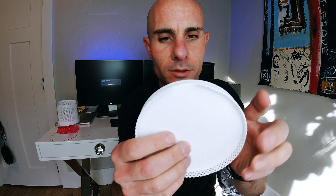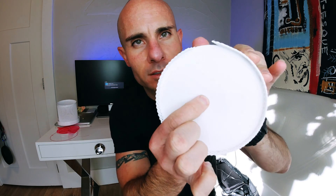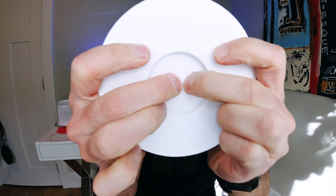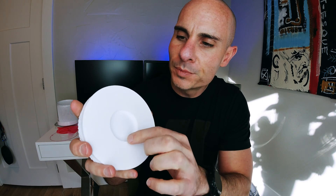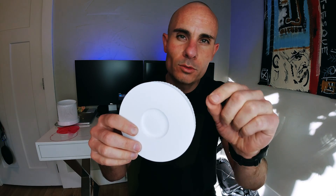So I obviously needed to take my top layer speeds down quite a bit. In the next print I slowed it down and didn't get that tearing, but what I did have was this center part was very soft — you can see how flexible that is. The reason is because of this bridge. You want to under-extrude on bridges and also crank up your fan. When you're laying down filament between two points with no structure over them and bridging across, you want the fan on so it's cooling the filament as it goes across — that's going to make it straighter and set the filament as it actually goes across the bridge.